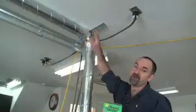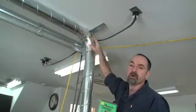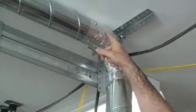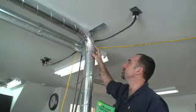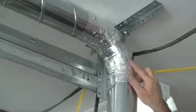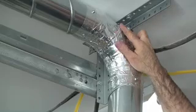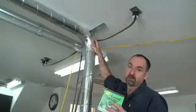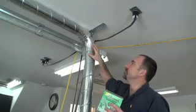There are 3 things I want to explain about what's going on here. First of all, the elbow is what they call a wide sweep elbow. It has a more gradual bend than the typical 90-degree elbows that you'd use for heating and ventilation purposes. Second, I've wrapped the entire elbow in aluminum tape. That's because this elbow has swiveling joints, so you can adjust the angle of it slightly. And that's a great thing, but the joints will also leak quite a bit of air unless you seal them after you've put the joints together.